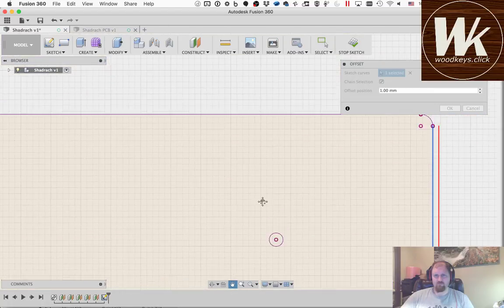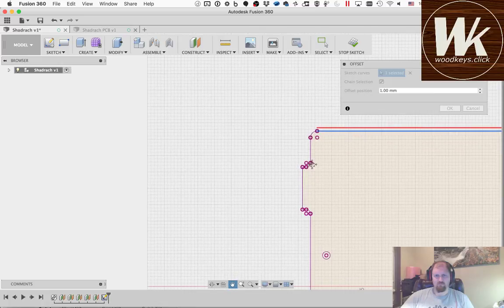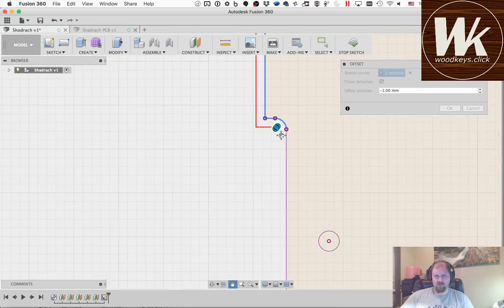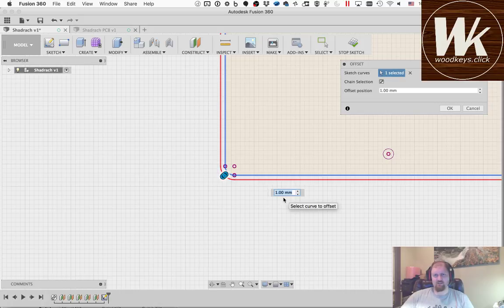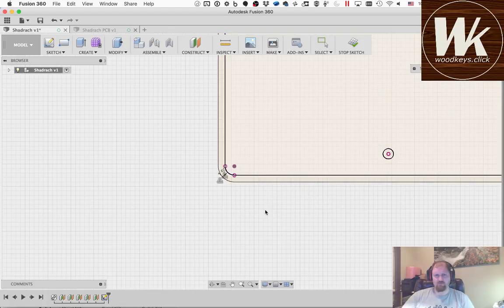Once again. And I'm going to go ahead and offset this to, you'll see why later, even though it seems like it's going to stick out, but it's not going to stick out the entire way around. Okay, and 1 millimeter I feel like is a good offset. That gives me 1 millimeter in any direction, so that's a pretty good offset. It gives me plenty of space. I've used larger margins in the past, and well, you know what, I'm going to go ahead and give it 1.5 just to make sure we have plenty of space around it.